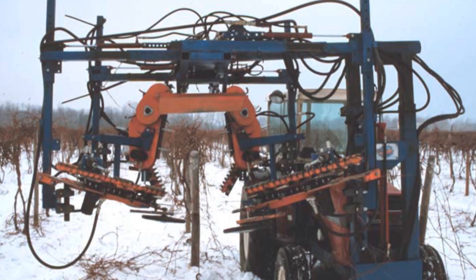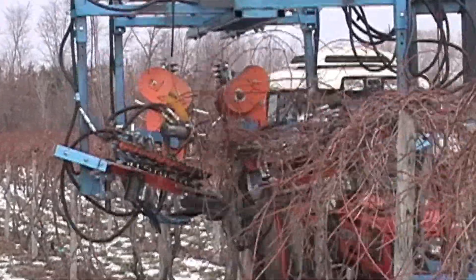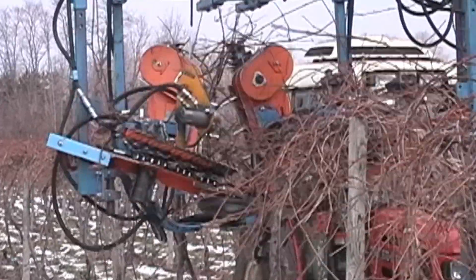Using the Morris-Oldridge machine as a base, Bob Betts, Tom Davenport, and myself reconfigured the machine to pull up and retain sun-exposed canes while cleaning out shade wood below the cordon. In comparison to the previous methods, we would consider this an upper 180-degree pruning.